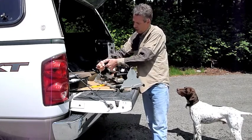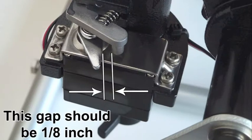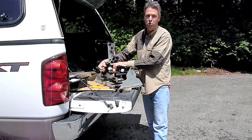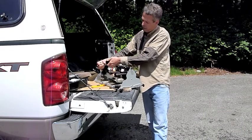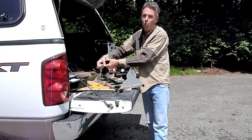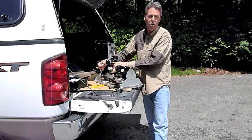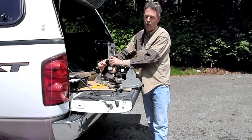When you cock the unit, the lever comes up, and it's very important that this continues to be an eighth of an inch. If it isn't, what happens is that the servo — if we just push it manually like this where there's no gap — you'll find that when you try to cock it, it won't cock because the lever is not allowed to go out. So a common problem with not cocking is bad servo alignment.